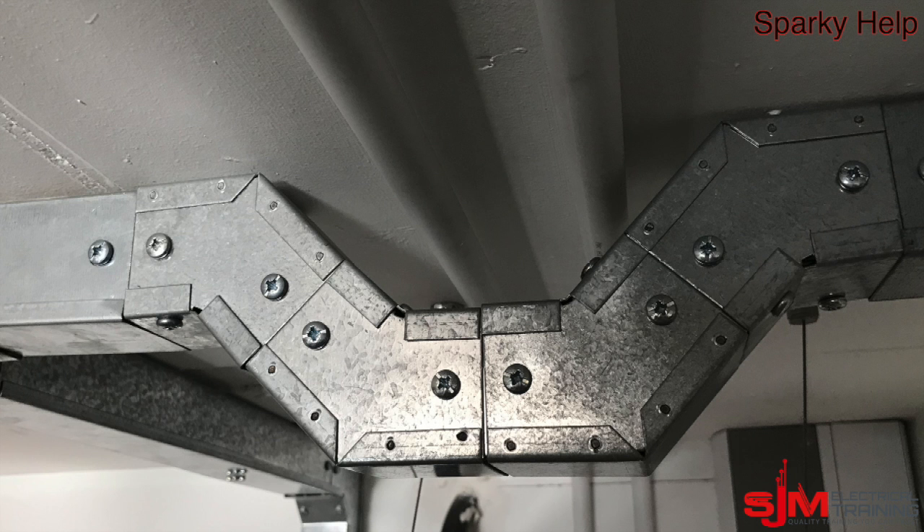Thank you and enjoy. So why would we want to make a shallower set? Well, look at this one here — when you buy the manufacturers' fittings and put them together, because the manufacturer makes them at 45 degrees, to go over a 20mm or 25mm conduit it's a tad excessive and gives you tight bends. So this is an alternative.